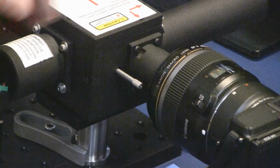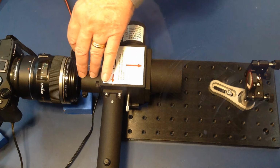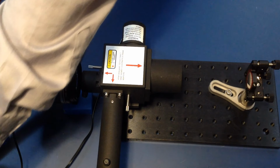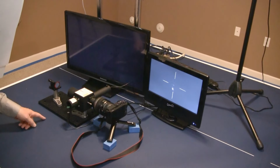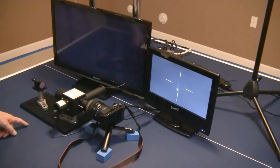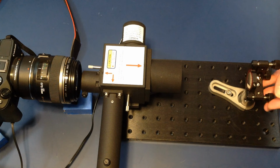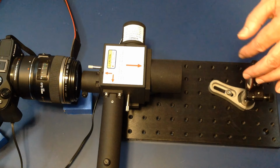After polarizer handle number 1 has been rotated into the beam blocking position, it should be possible to observe the point spread function of the incoming test mirror signal beam on the AV display monitor. This is possible because some light leaks through the partially transparent pinhole aperture plate. The size of the point spread function will be an indication of how far the test mirror is from best focus. In order to improve the focus of the point spread function and thereby reduce its size, the 3 micrometer screw adjusters on the mirror mount must be adjusted sequentially in the same direction, either clockwise or counterclockwise. This has the effect of changing the distance of the test mirror from the SPPDI.